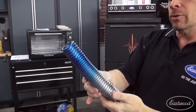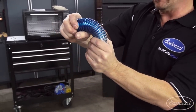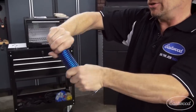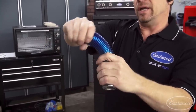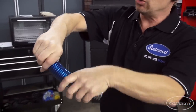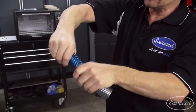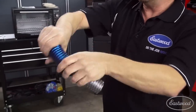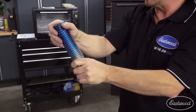I wanted to show you this powder. This is a chrome radiator hose. I've used a translucent blue over the radiator hose. Now, if I had painted a candy, like a urethane clear coat that's tinted over top of this, it would be like a bomb going off. You'd be seeing paint splinter off everywhere. I coated this years ago to do this demo. It's a cool candy look over top of chrome, virtually no prep, and the powder doesn't care. The powder has enough flexibility that you can just keep manipulating it, which is great for hood hinge springs, coil springs, things like that.